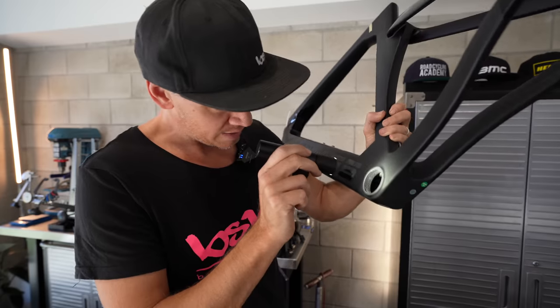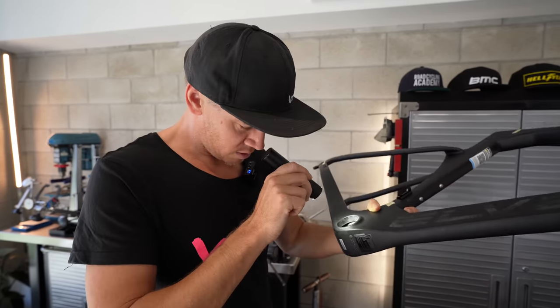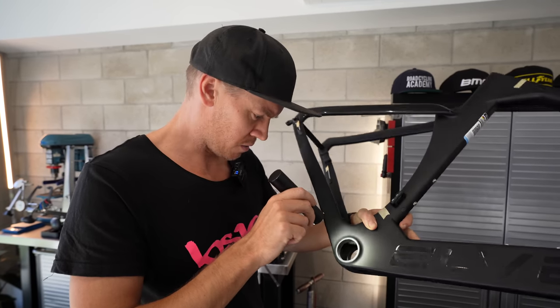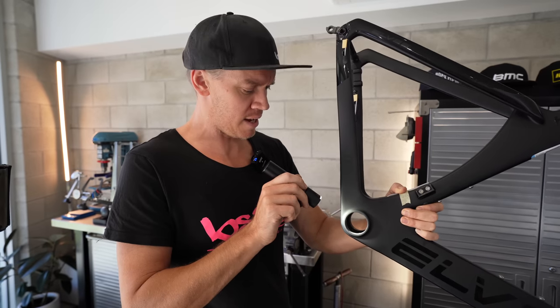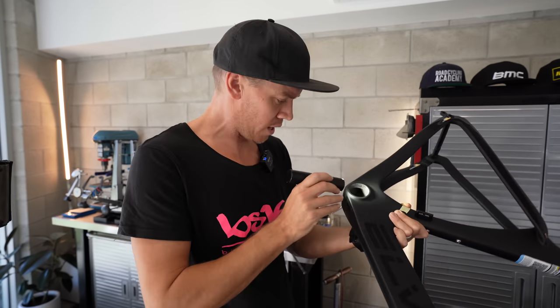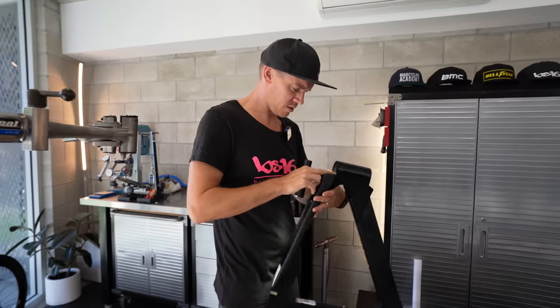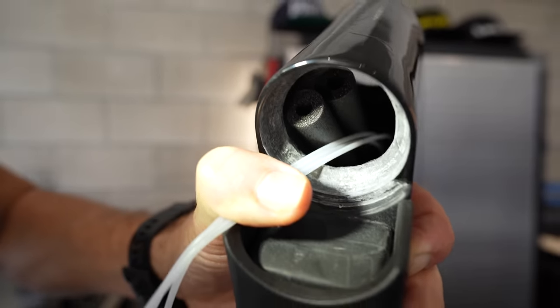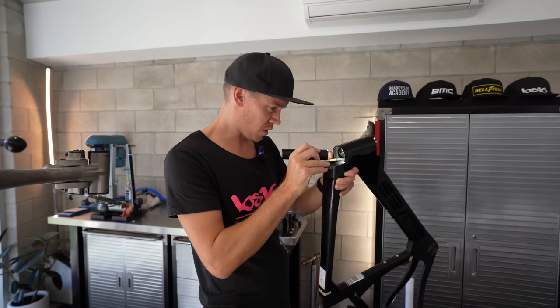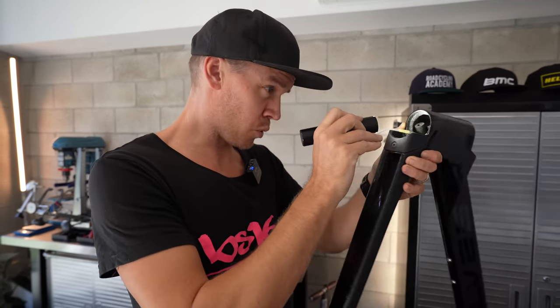Get Carbon Steed to look at it. And then the cups — the actual manufacturing of the bottom bracket area — they're not the same thickness all the way around. If you look up inside the frame, there's a huge piece, like a strip of what looks like glue. Obviously you don't need that excessive weight — it's already a heavy bike. You win some and lose some between the two frames. Look at the lower section here, to that bearing seat — it's all crumbling away. That's pretty poor, there's lots of pitting there. If you're going to go to Gary, I'd get him to check all that because it looks like it hasn't been compressed properly.